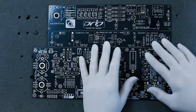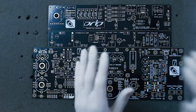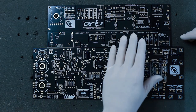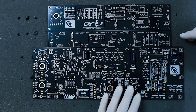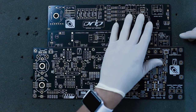Now I'm going to place all of the parts on the board. This is really simple — I'm going to place parts and jump around. Place all the low-profile components like the resistors first, then the capacitors, then any other parts, and save the switches for last.